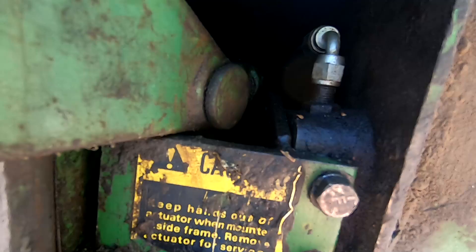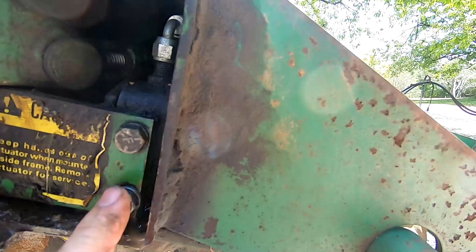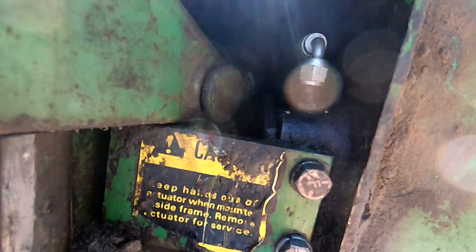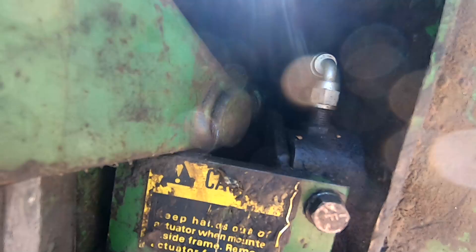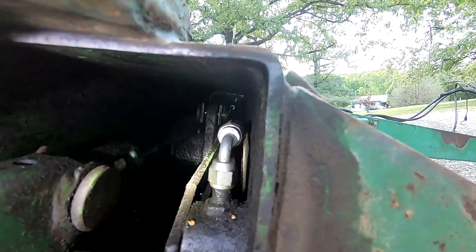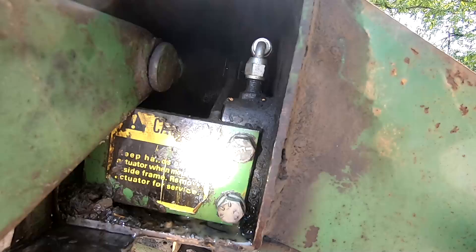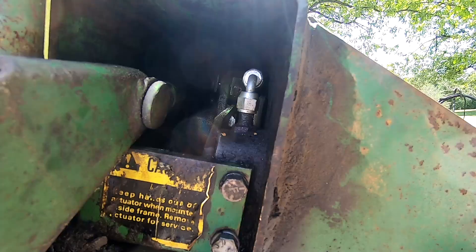So what we're looking at in there — I'll get a flashlight in a minute — we have a cylinder right here at the end, it bolts in right here, and we've got a hose connection right here. We're going to try to figure out where this thing's leaking. With the flashlight, we can see a couple of hydraulic connections and the cylinder sitting right here, and I can see oil in there but really can't tell more than that. So we're going to take these bolts out here and this whole assembly will slide out this end.